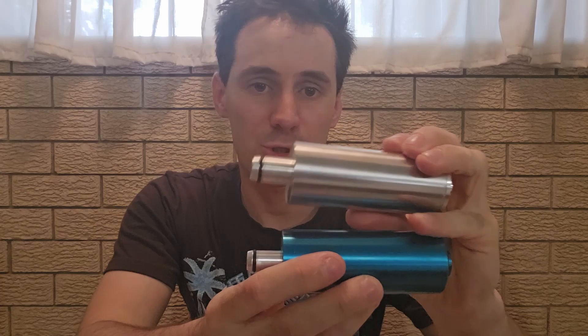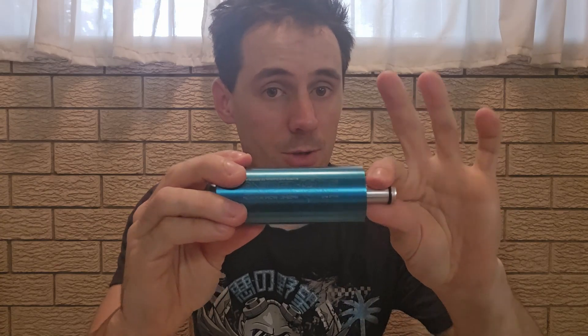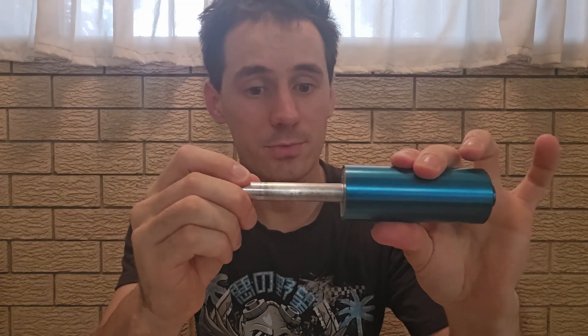This is Snipercore — Spectre's new improved pneumatic exhaust ram. It is a fully aluminium HPA core designed with the same external dimensions as Supercore, but it is open bolt instead. Open bolt means that when the core is pressurised the bolt is actually retracted. When you pull the trigger the bolt extends, fires, and then retracts back. There is a spring inside the core, so much like Supercore, if you pull the bolt out by hand it will retract by itself.